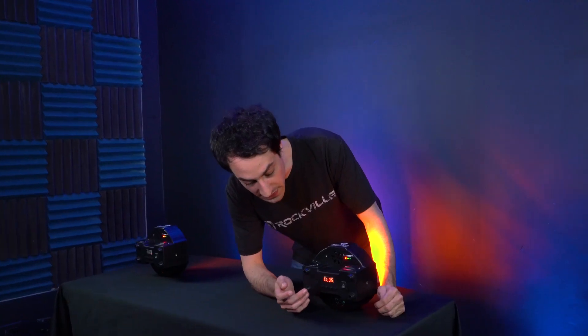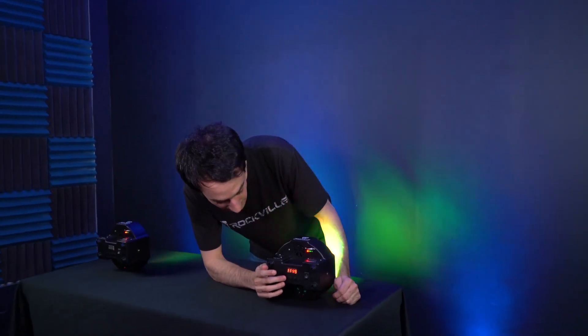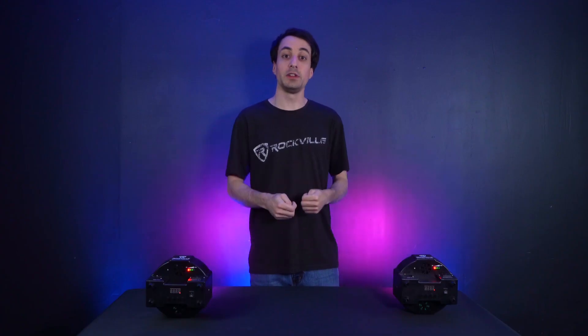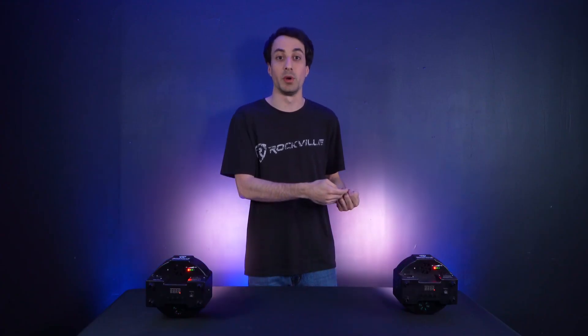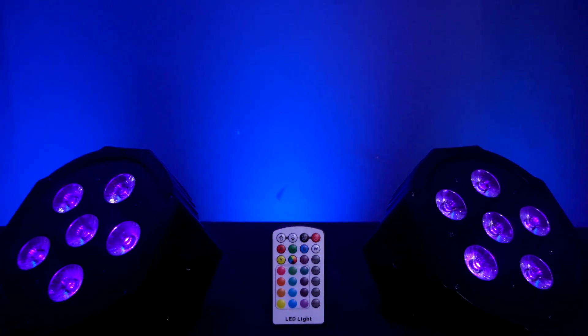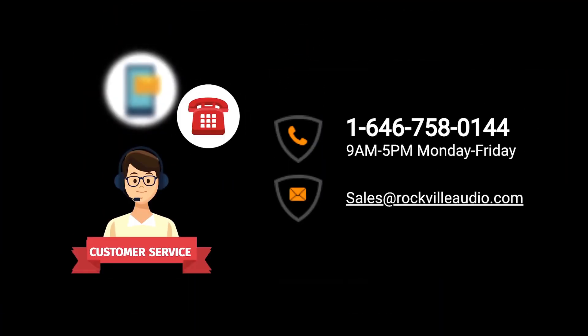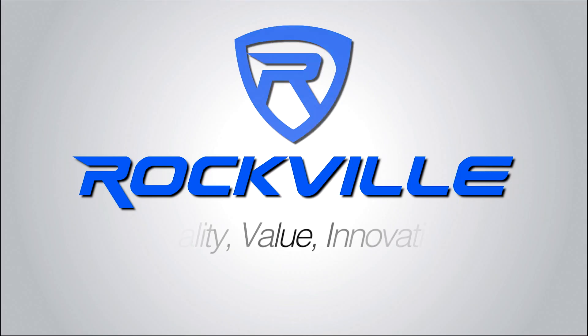You can also send preset modes out via the master light, such as color changing, color fade, strobe, and even sound mode. Note that when using the wireless DMX function with master/slave configuration, your RF remote will not work — to re-enable the remote, set the light back to REN mode. Hopefully this showed you how easy it is to set up your Battery PAR 6RF rechargeable wireless DMX light. For any questions, comments, or concerns, reach out to our customer support team by phone or email. I'm Perry from Rockville — see you guys next time.